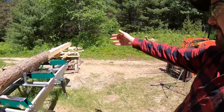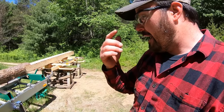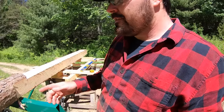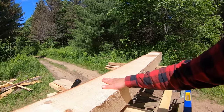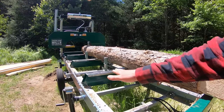And it was already nice out there. I had lots of room to work. So I figured take it down, rotate it best I could, put it back. Now, you also would have seen me a few minutes ago with my level. What I'm doing is I'm making sure that this plane here is level to match the plane of the saw bunks, because these are level as well.